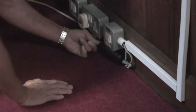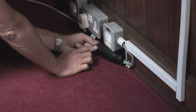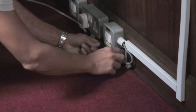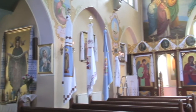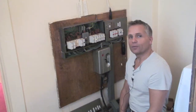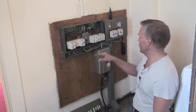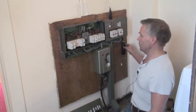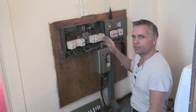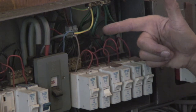I'm going to extend the aerial and, if possible, access to the LED which tells you what's going on, and the reset button. This can be tidied up, of course. I'm about to install the second wall lighting circuit receiver. What I've already done is put one in situ here, and all it does is sit in line with the existing switching, so the existing switching doesn't need to be moved. And there's the new wiring for it.